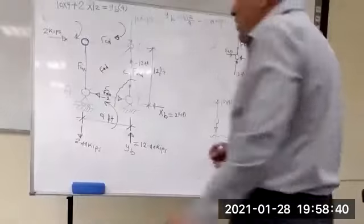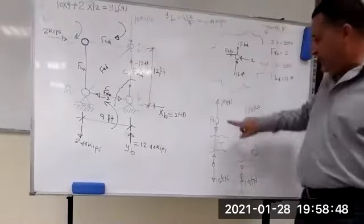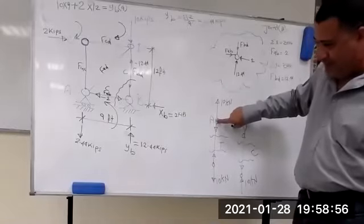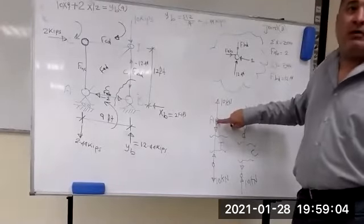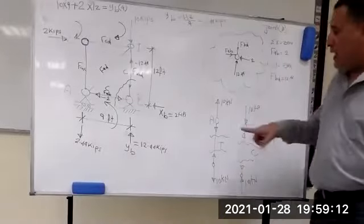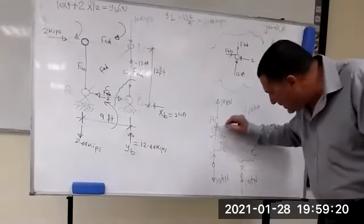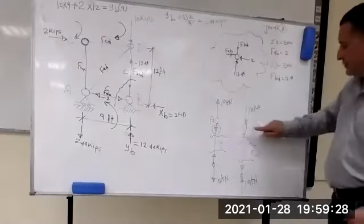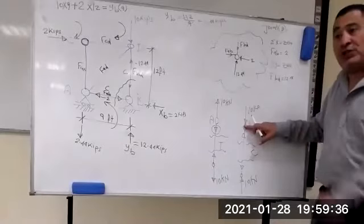Negative. I told you, put your finger on the joint here. Look at me now. This joint A. This force, the internal force now, indication of the internal force downward. Put your finger here. What is this force doing to your finger? I told you, follow my technique and you will solve it easily. Don't solve it by minus, plus, it will confuse you. Simple way, put your finger here on the joint. Is this force pulling your finger or pressing your finger? I am talking about this force. Pulling? Give attention. If the force compresses your finger, that means compression. Simple, guys.